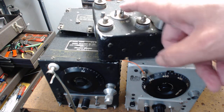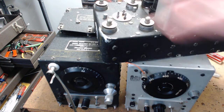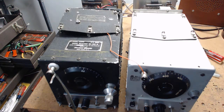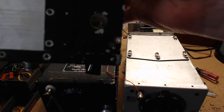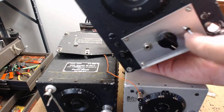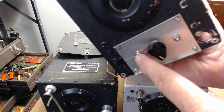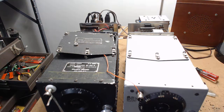This connector is for three miniature banana jacks - this will be missing. There might be a connector that doesn't belong on the radio - it's been botched, it's not an original radio. Looking over the cabinet you might find an extra hole in the front or on the side - that's because the person was too lazy to make a plate. This is the BFO on/off switch, there's a 50k pot, and your earphone jack.